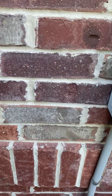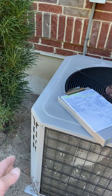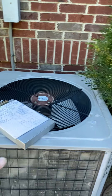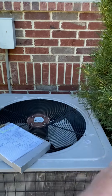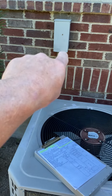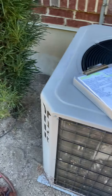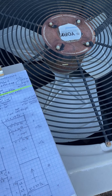It has an outlet and stuff in there, so we'll get a complete circuit up here. We'll add a 40-amp breaker on our new disconnect. He requested that we move this pad over center in between the two trees so it's not right tight against this one. He's been told he needs to keep his trees trimmed back to keep them from sucking into the unit.